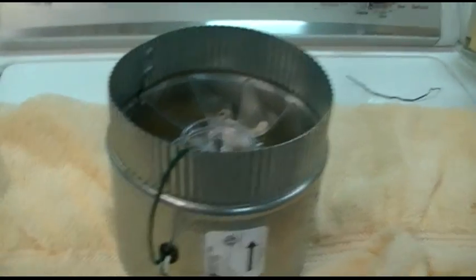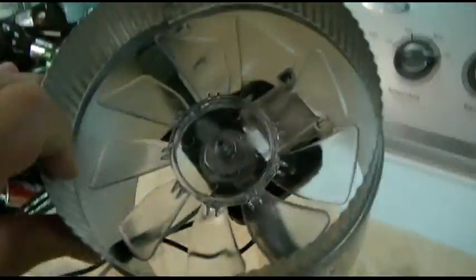It's Sunday, I'm off, I'm on vacation. I got vent fans — inductor vent fans. They're a shaded pole motor with plastic blades because China says that's good enough. The reason I got these is because we got these two vents for the central AC. They run down here and there's a third which runs up and over and all the way back to the air handler. One goes out to the far corner of the dining room, the near corner of the dining room, and one goes to the kitchen.